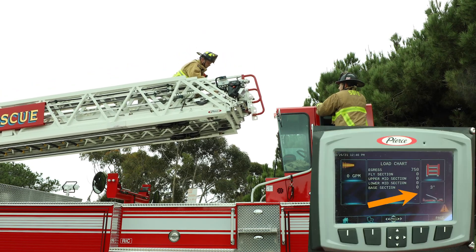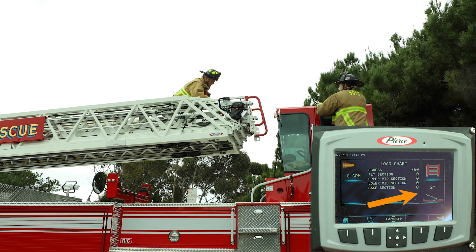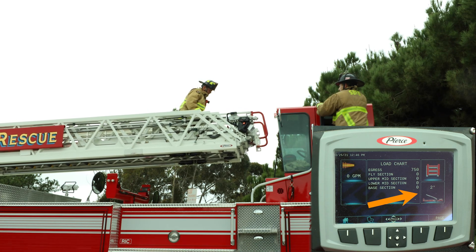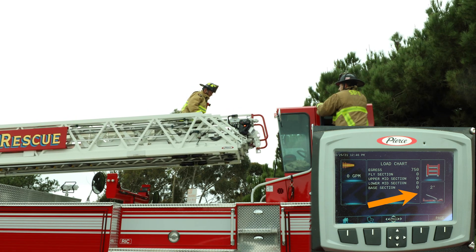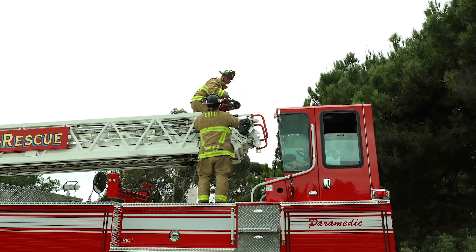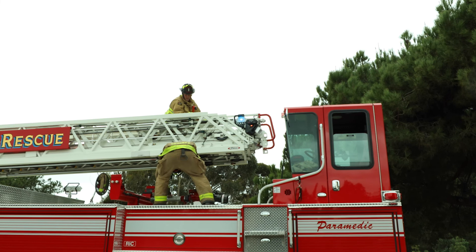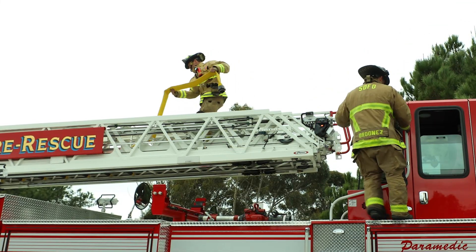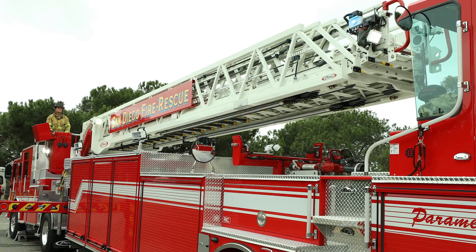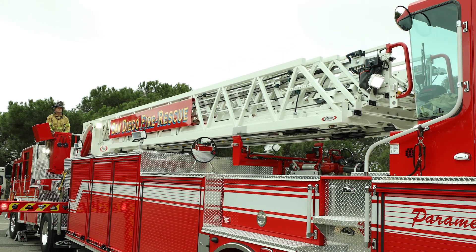When the ladder reaches two degrees incline, the ladder operator can again rotate left or right of center until the beam aligns with the opposite corner of the tiller cab. The firefighter on the ladder can now pass the nozzle down to the crew member standing on the trailer, where it will be secured back onto the trailer nozzle mount. The firefighter walks the remaining three-inch hose into the storage compartment. After the nozzle is secured and all members are off and clear of the ladder, the ladder can be completely stored in its cradle.